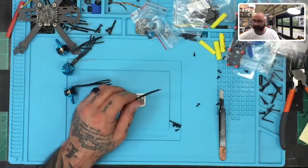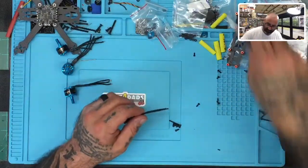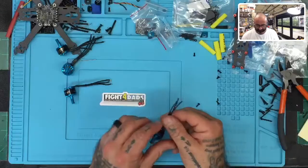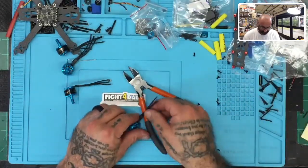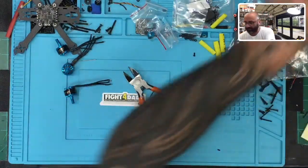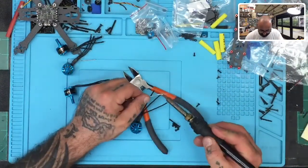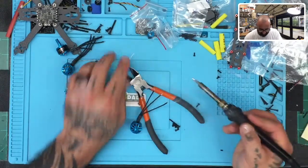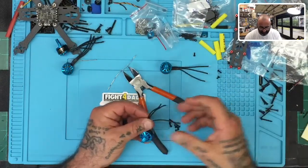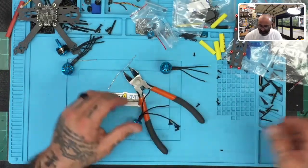All right. With that done, put the scissors away, put the wire strippers away. There we go. Okay, so now we need to tin it. There are a couple of ways to quickly tin this. I'm just going to lean the wires up on a tool, like my wire cutters right here, and spread them out a little bit. Then I take my soldering iron and a piece of solder and very quickly cover it. Because you applied flux prior, it's going to stick really well. So let's get the next one, spread these out, make sure everything's twisted well, and then just lean it up just like that.